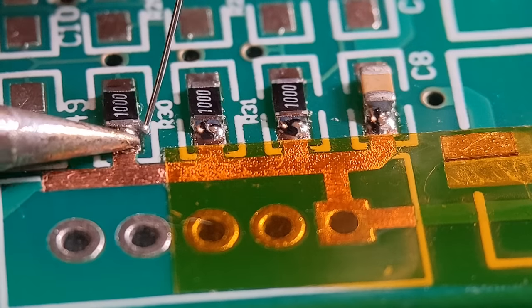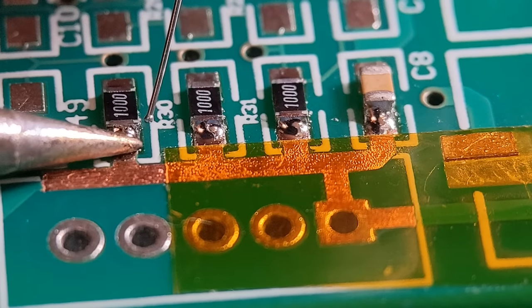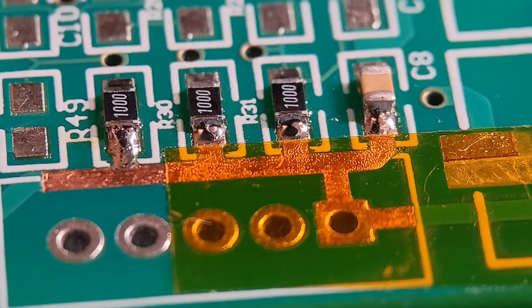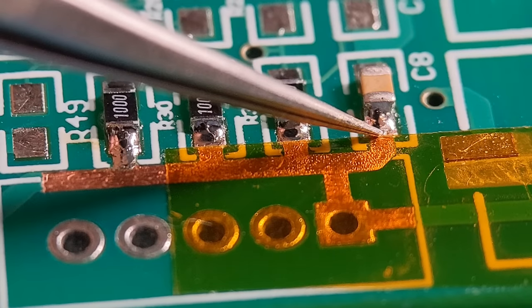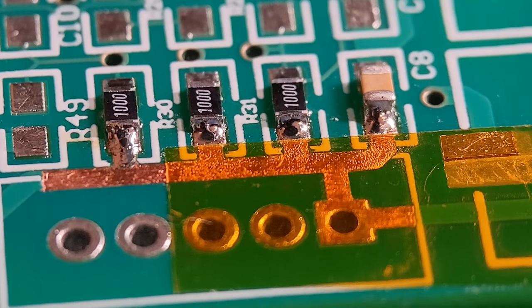With this one, you can see the solder's already gone beyond the point. If you had your iron on there much longer, you can see it go right along. If you've got way too much, it's going right out onto here. Whereas the others have all stopped at the very point where we said it should stop. So you can see how the tape's done its job. I'll just peel the tape off, clean them up, and you should be able to see the results clearer.